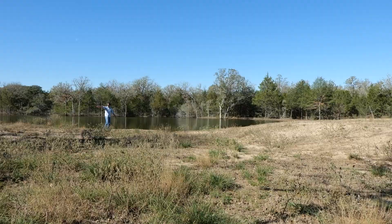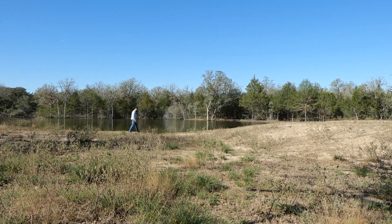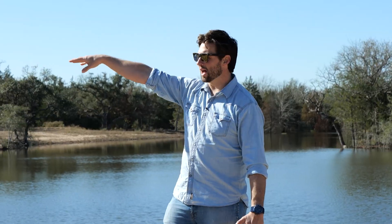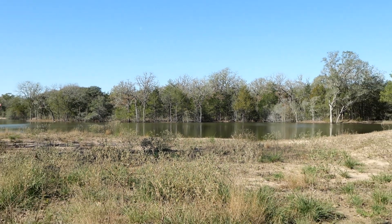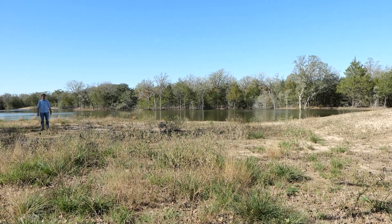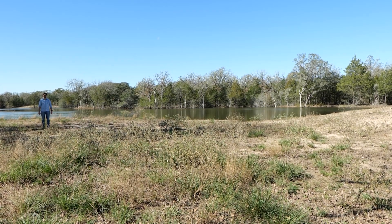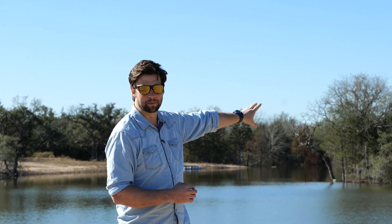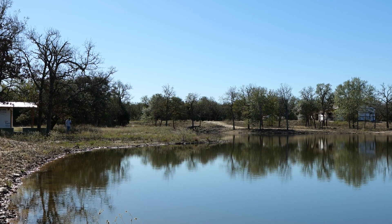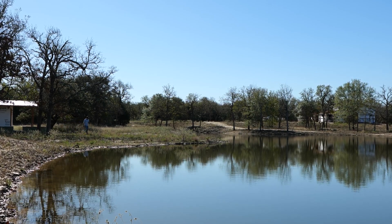This north spillway sets our height, and as soon as that can't keep up, the southern spillway starts to go. On the far south side of this dam, it's just a big prairie, so we can move tons of water across a broad, wide — probably 75-foot-wide — meadow. It can carry way more water than all of the water coming down through the draws up to this point.